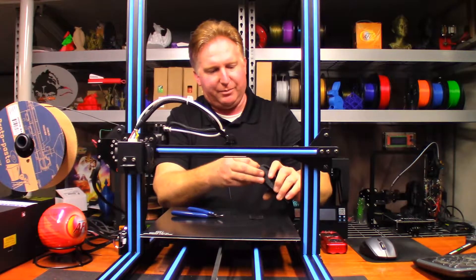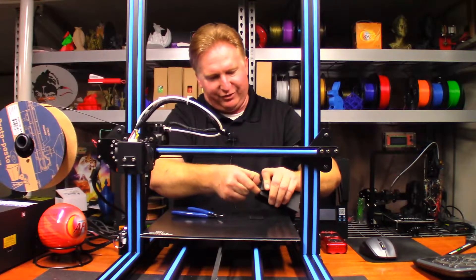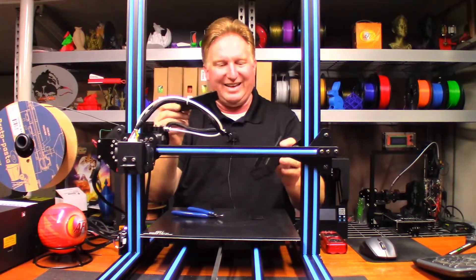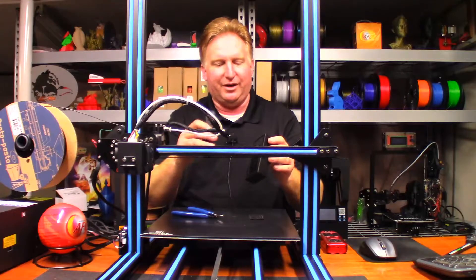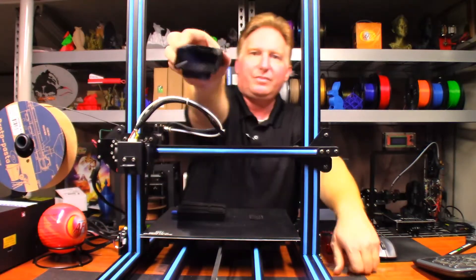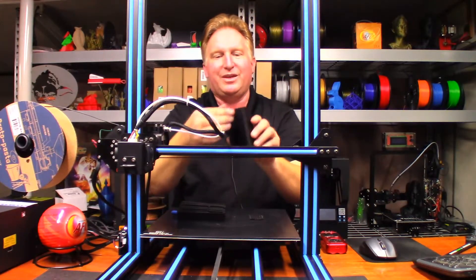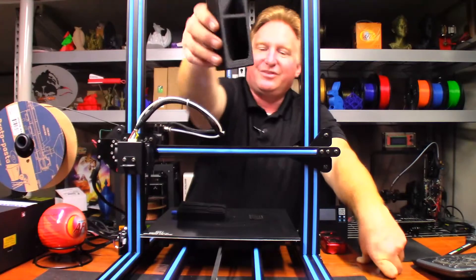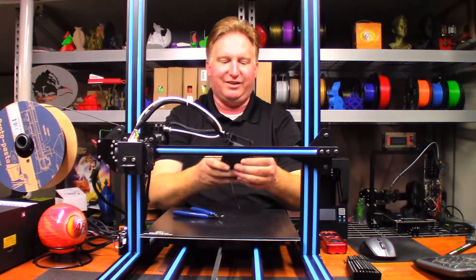Okay, it seems like it's coming loose. I can't tell if it's going to actually come out — but I'm surprised it came out that easily. I did some adjustments and set it 0.3 millimeters away from the build plate and away from the roof of the print. You probably can't tell, but it is smooth on the inside — it came loose very nicely. I'm surprised it came loose from those cross members without breaking them — that is a really good deal. If this was PETG, I would never be able to remove those that easily.